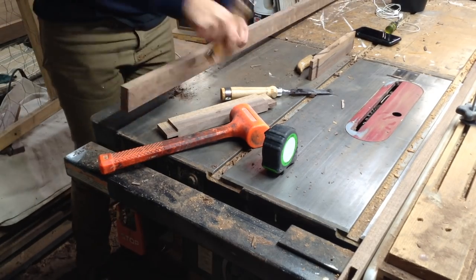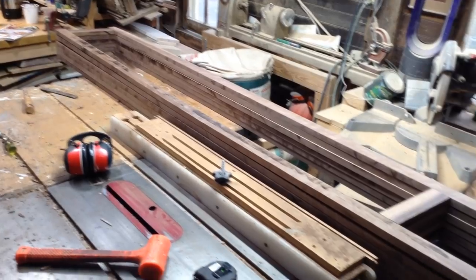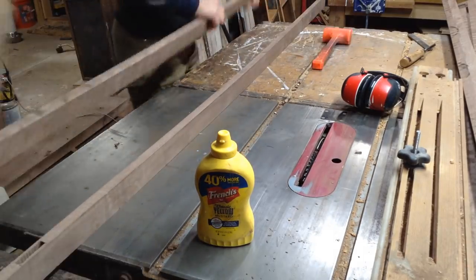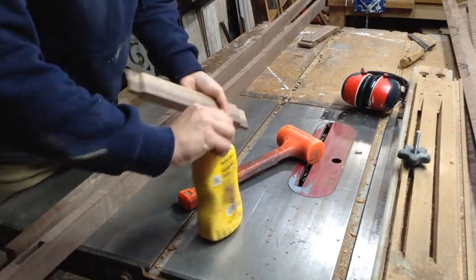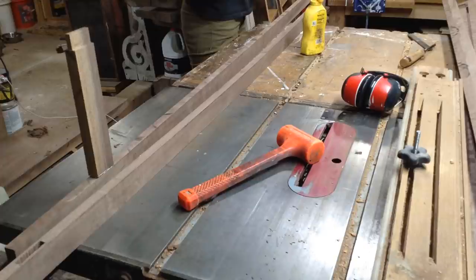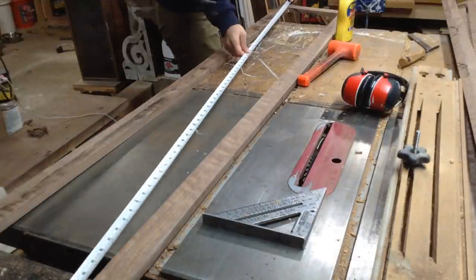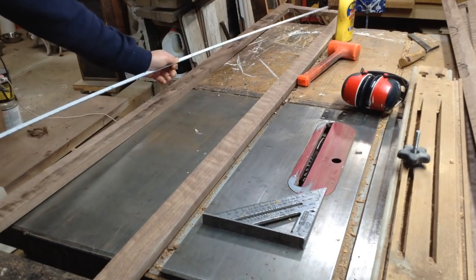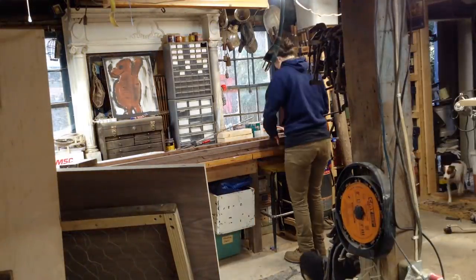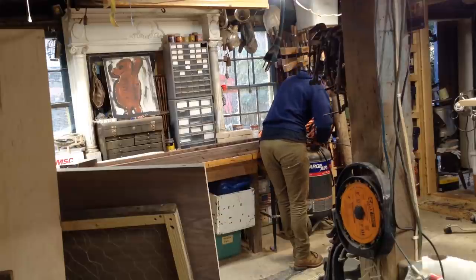Now that I have my cross members I'm going through all the mortises, cleaning them up, making sure the tenons fit, and once they do I move them into a stack. There's one on the bottom and one on the top, and once I have a nice tight fit I can move to the other end. There are six frames total. I didn't have a ton of clamps, so I glued them one at a time and clamped them in stacks of two. Whenever making multiples I like to stack them on top of each other — differences become obvious quickly. I checked square and they turned out nicely.